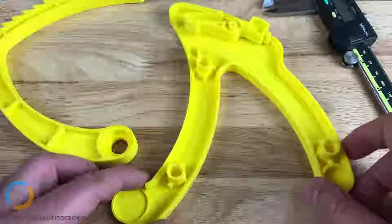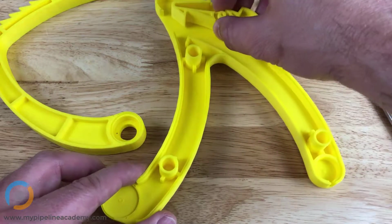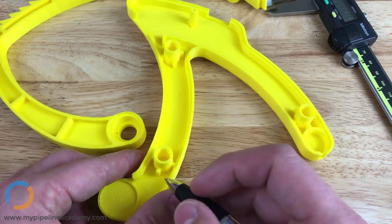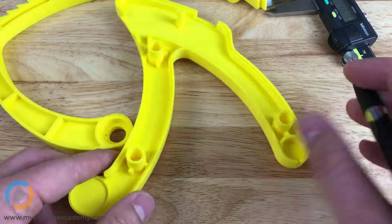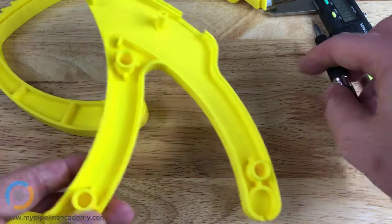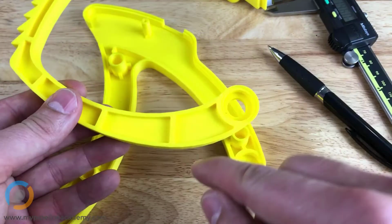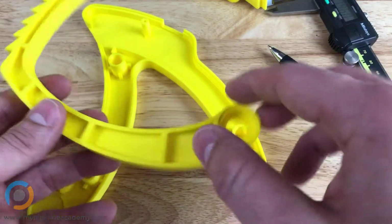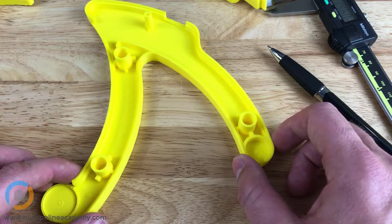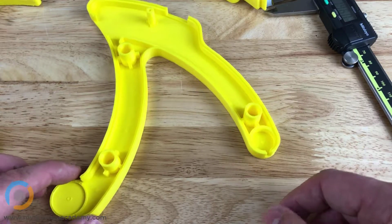When you have ribs in a part, or anything that isn't the fundamental foundational geometry of the part, you want those ribs, or in this case they're bosses. Oh, a rib. So like this right here, that's a rib. And you can see several of them. Here's a rib right here, and there are some ribs over here as well. Ribs are used as structural supports. So ribs make the part stronger. In this part here, you can see we have some ribs there and there and there. A rib is an efficient method of adding structural rigidity and strength to a part without just filling the entire part with material, which you don't want to do because then you would not have a constant wall thickness.